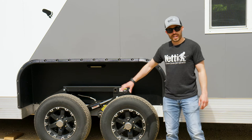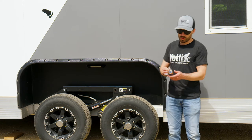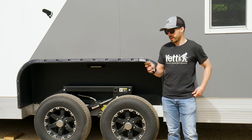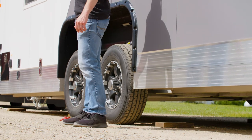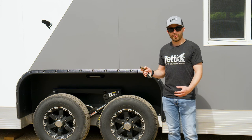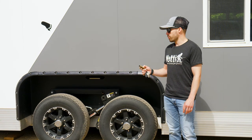Now that we've put all eight blocks down around the house, it's time to lower the house. In this case we have a hydraulic unit, so I'll simply use the lower-all button. While you're dropping it, you're going to want to double-check that your blocks are directly lined up with the main frame rail. In this case we've pre-aligned everything and are confident we're hitting the blocks.